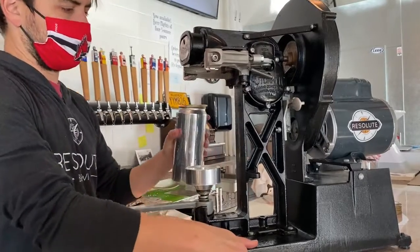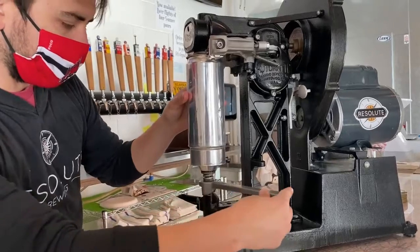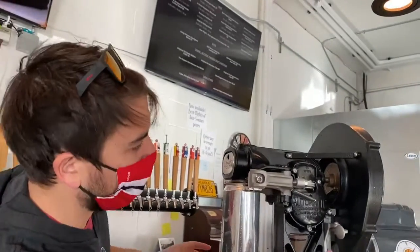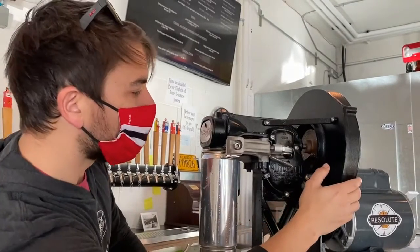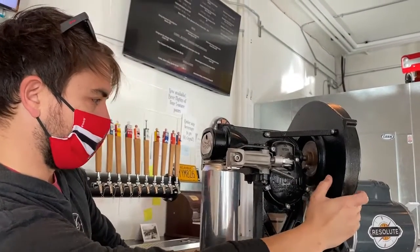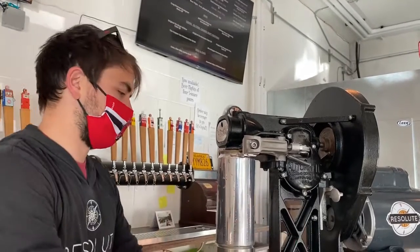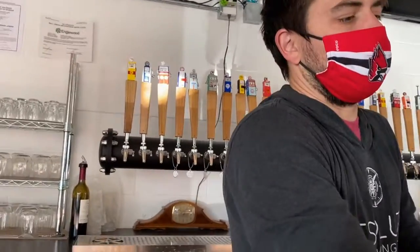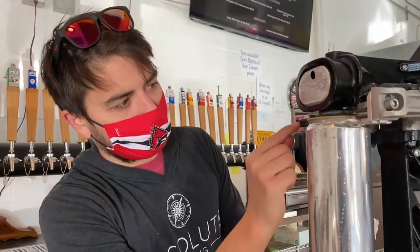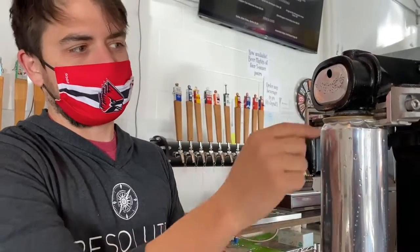I don't know why or which. Might need a towel after this. Usually I can tell which arm by just watching it seal. It's this side. If you watch it ever so slightly as you run it, you can see where these are making contact and crimping. If one side's making too much contact, it'll dent. It's like squishing the can.